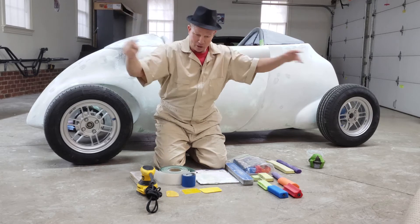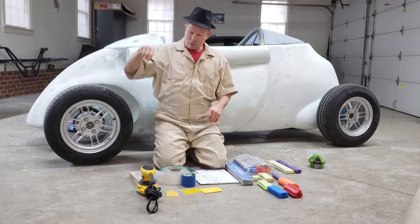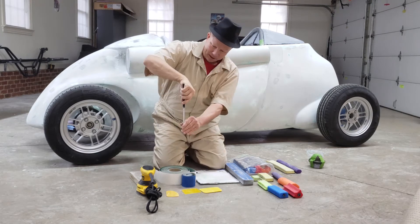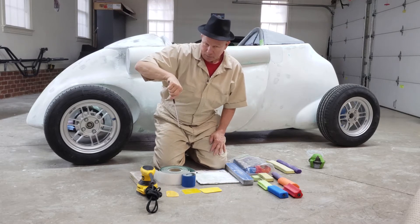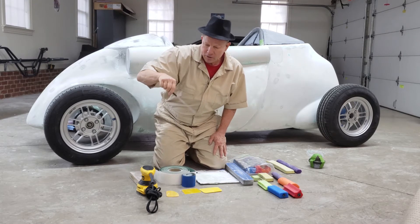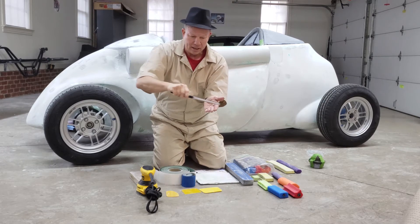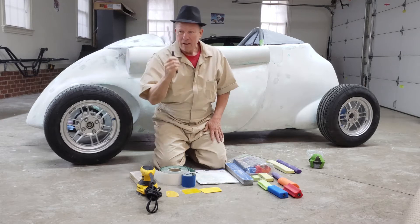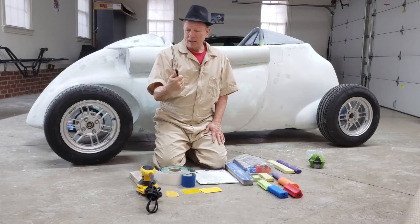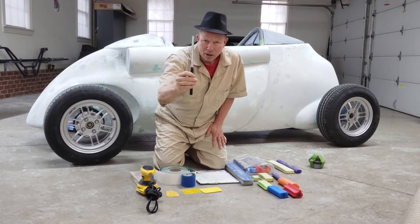When you're cutting big sheets or big slabs of foam in whatever shape you want — if you want to do plunge cuts, just dive it in and you can make very intricate, tight cuts. If you want to make long straight cuts, use it at more of an angle and let it cut inside its own groove. It cuts really straight, really fast, and doesn't make a lot of dust. It's the one tool you need and it probably costs about a buck to make.